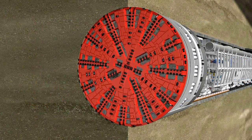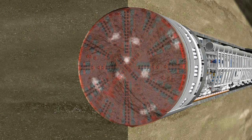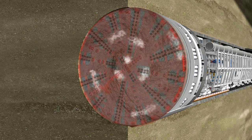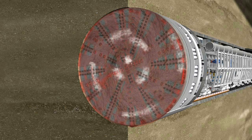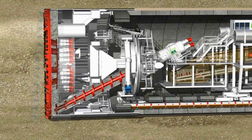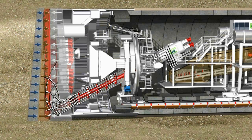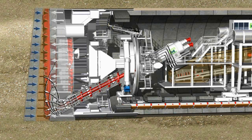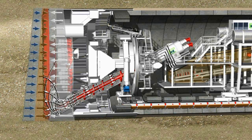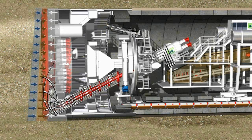The internal stators and rotors cut through the soil mixture, while foam can be injected via nozzles to ensure the required consistency is maintained. The aim is to keep a balance between the volume of soil removed by the screw conveyor and the volume of soil being produced by the advance of the EPB shield, making it possible to ensure optimal support of the tunnel face.